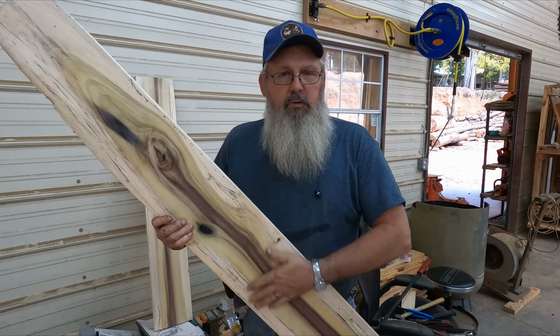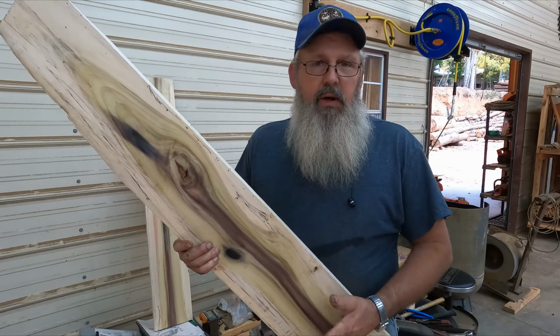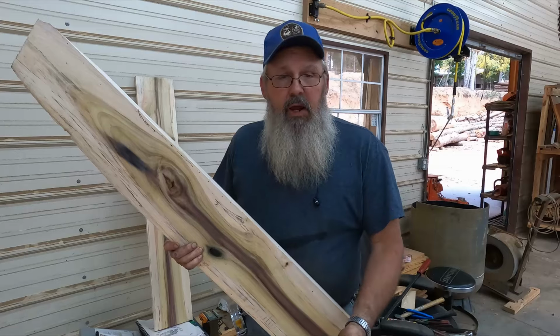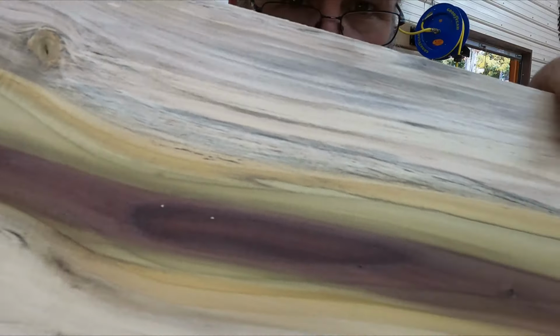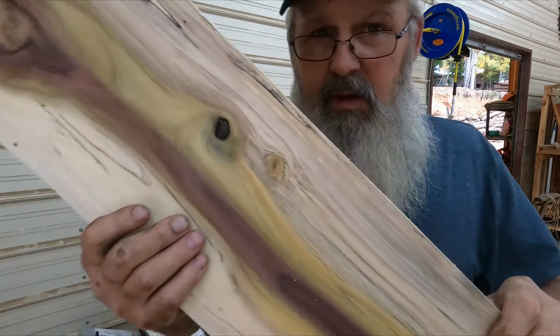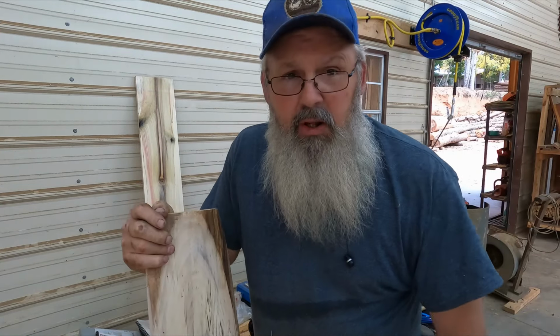This is the bottom cut, which will become the, in S4S it doesn't matter, it could be top or bottom, but we're learning. Normally we're gonna run product face down, so we'll make sure we take enough off so the face will be finished. Hopefully you can see the quality of finish, but yeah, that's good. I'd hit that with 120 and 220 sandpaper and be done with it.